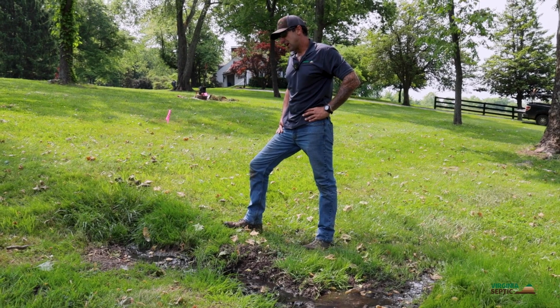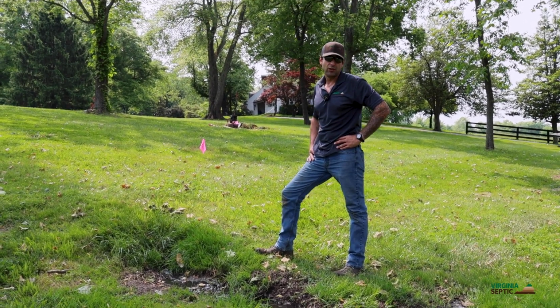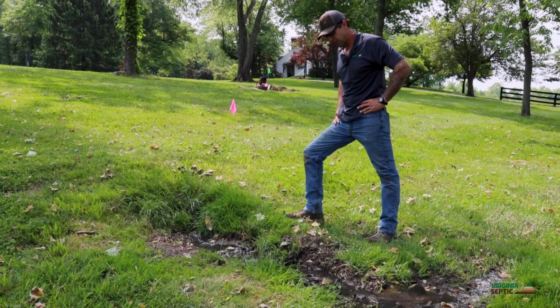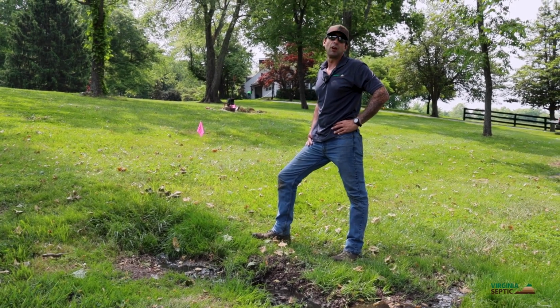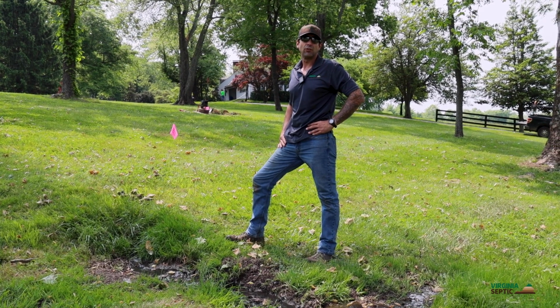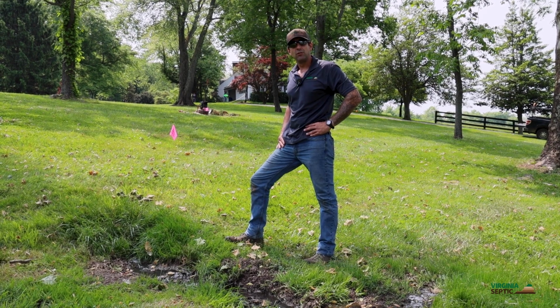What has to happen if it's not operating in a safe, adequate, and proper manner? A new drain field needs to be found, okay? At this point, I don't think there's any repairs that can be done to this drain field. At this time, we would probably go ahead and get a hold of our sister company, Soils Inc., and have them come out here and do a complete soil test to find a soil study, to find a new drain field for this place.